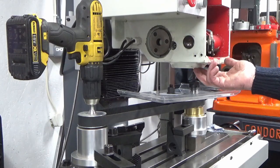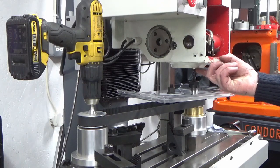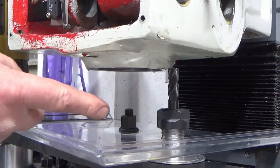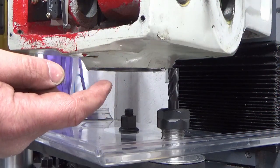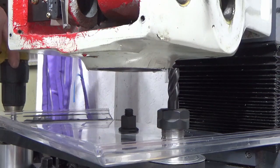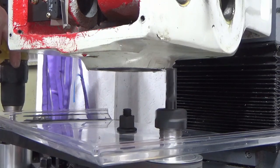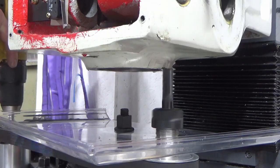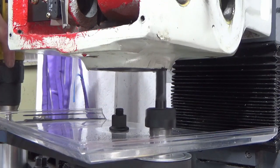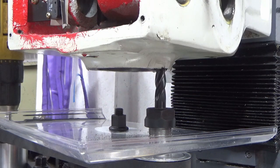But I'm going to use my DRO to try and control my depth when I'm winding my head down to advance the cut that we're going to do to try this out. Exciting times. Let's see what happens. So I've touched on, and just to start with I've put 1/2 mil depth of cut on to try and get some sort of idea what this is going to be like. So here we go. Well, it cuts.